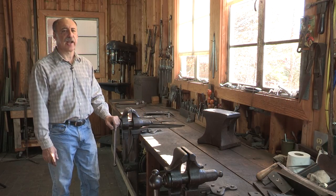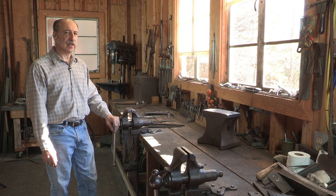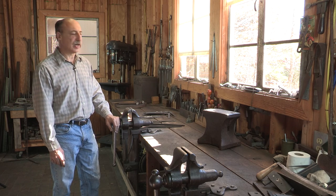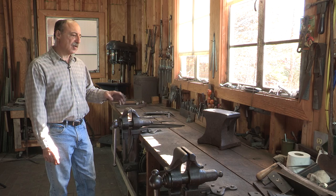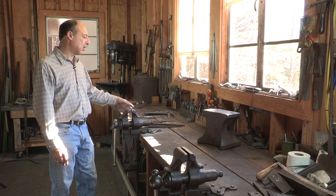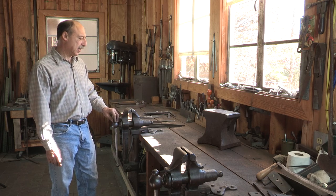Let's look at my bench and the tools I have here. The bench and its layout is really important to me since much of my work involves filing, assembly, fitting, and cold adjustment — as is really typical of 18th century small ironwork. I spend as much time here at the bench as I do at the anvil in many cases. I have a fairly large bench with lots of open space, which is really important for laying out tools and the work at hand. A project like a lock may involve 20 or 30 parts, and there's room to lay all those out.